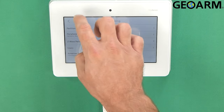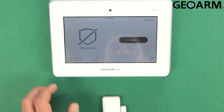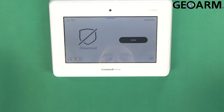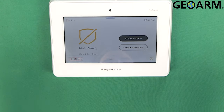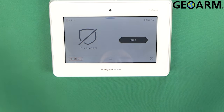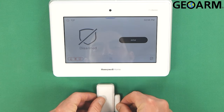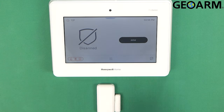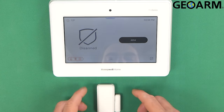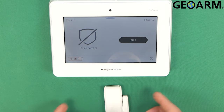You'll see the zone there and you'll see its battery and its signal strength connection to the panel. We're going to go ahead and back all the way out of programming and test this device to make sure it's operational. I didn't program the zone descriptor on it, but that's how you program this device in there without the descriptor. You can get the descriptor in there — you can put in front door, back door, whatever you'd like. So once again, this device is operational — open and close.